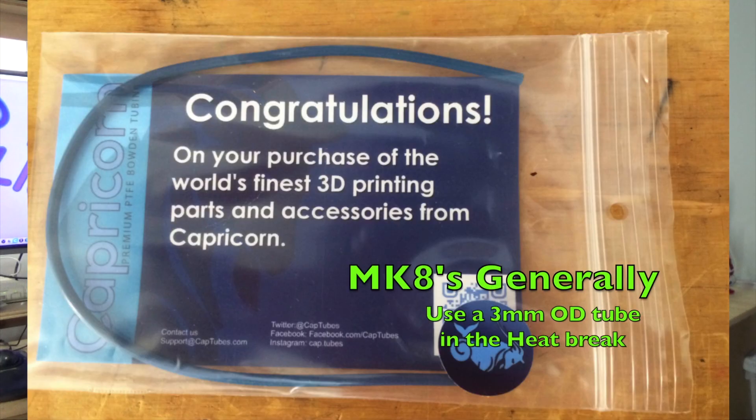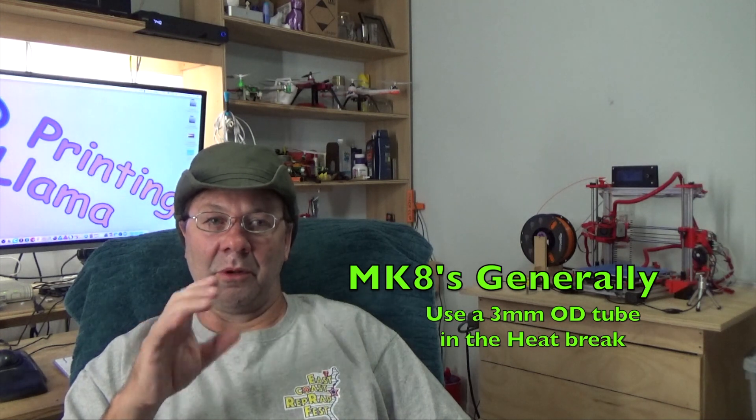This is a very first impression. I have never been able to print PETG before, so this is actually a two-part review. MK8s all use PTFE lining in the heatbreak and hot end, and every time I tried PETG it wouldn't print — either the temperature was too low or it would start burning and clog the PTFE tubing. Funny enough, I could print ABS but never PETG.